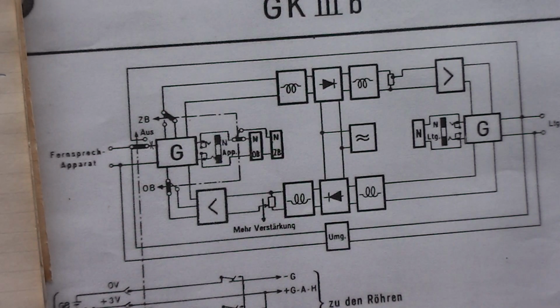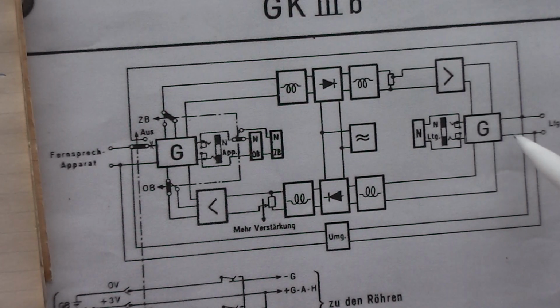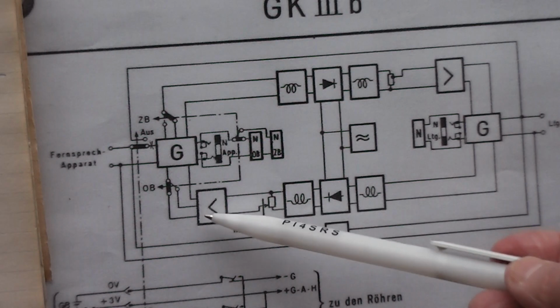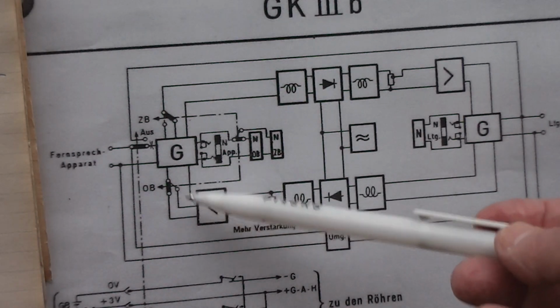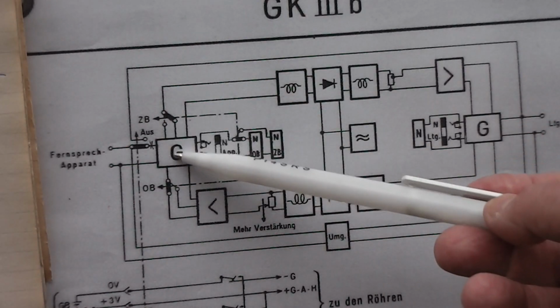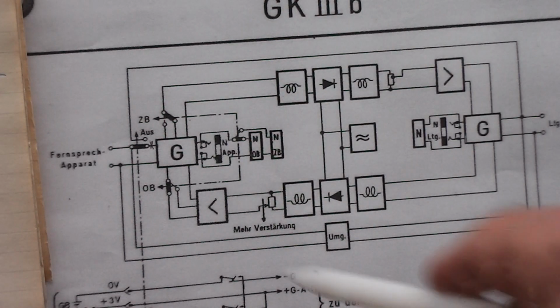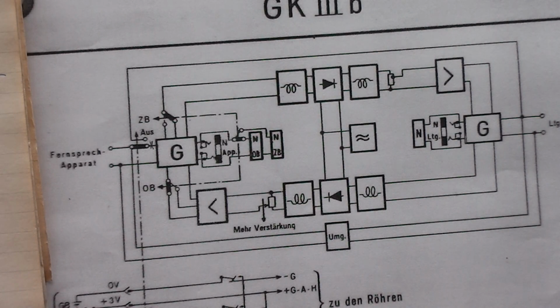And this is important because when this would not be the case, both are working on lower sideband. That means that here the signal which is to be transmitted in the direction to the line, the output line, would also be received and handled by the receiving side. And if that would not be prevented by this fork or Gabelschaltung, hybrid Schaltung, you would have oscillation, because the signal here is also entering here, and you get a loop, and it starts generating positive feedback, as we call it, and technically the circuitry amplification is 1.